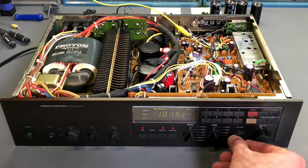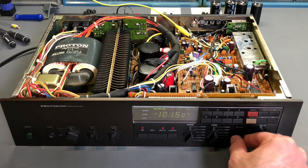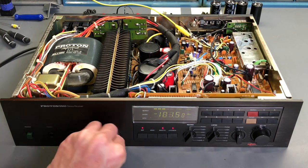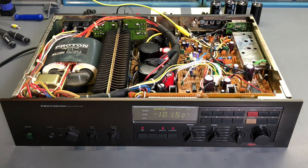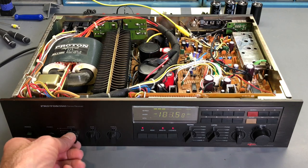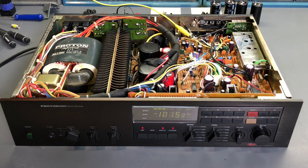The balance control works correctly — on the right channel now, it fades off on the left, fine. No crackling or static sounds when turning the controls. The selector switches are working correctly. At this point, I'll finish reinstalling the tuner circuit board — everything appears to be working correctly. Then I'll connect a dummy load to the output, check the amplifier output power to make sure that section is working correctly, and take a look at the schematic to explain the dynamic power on demand and what Proton was designing with that idea.